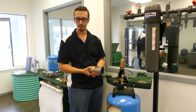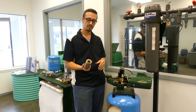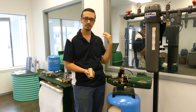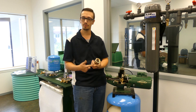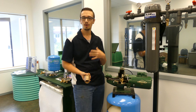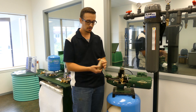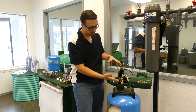When it comes to a check valve with a jet pump, typically the only time you'd use a check valve in place of a foot valve is if you've got extremely clear water — like reservoir and cistern applications where you're drawing from water that's already clean. So those are the two options.